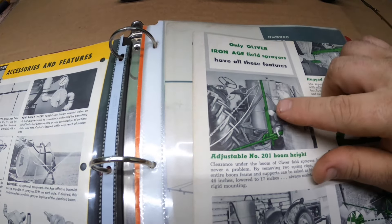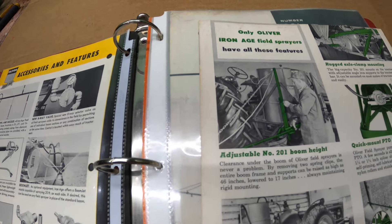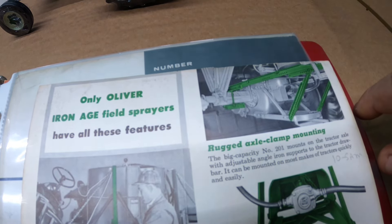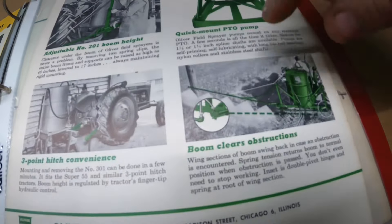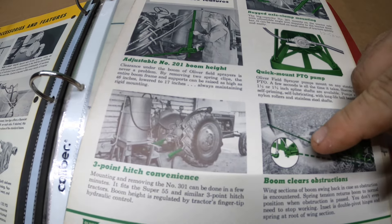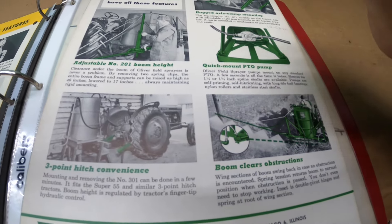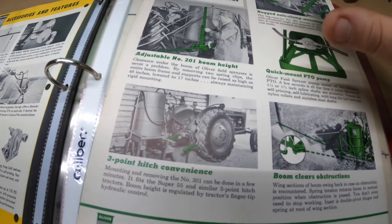There is more of what I bet I had right going on. It's made a little different on this one — extendable framework, you can adjust the height of the boom. The thing about the booms is, and the toy doesn't reflect this, you have to have a way for it not only to fold up, but to also break away in case you hit something. So it has to be able to turn in two directions — you can't just bolt a piece of angle iron through the frame and lift it up. You've got to have enough stuff to break away.